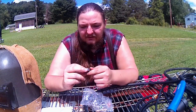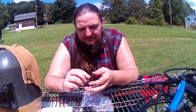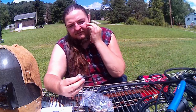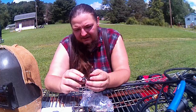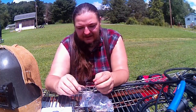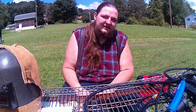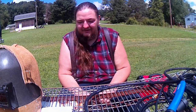And then, yeah, so is this one here. But the main one here, it's got .030 and .040 roller, which is kind of an odd size. Usually you'd have the next step, but that's okay. The MIG wire I have right now is the .030, so this will work fine for me. And I forget which size was the one in there, but I do know that this can accept up to .045 size wires from other things I've seen and looked into.